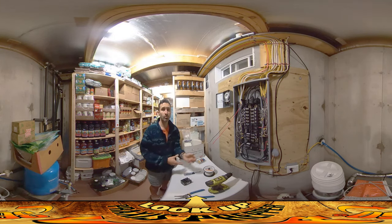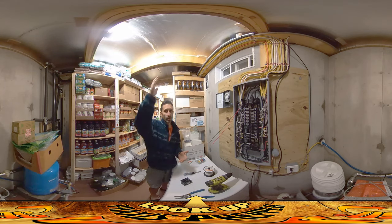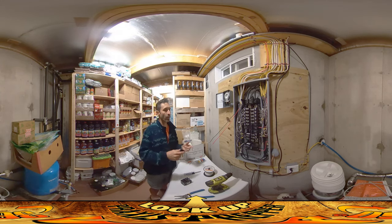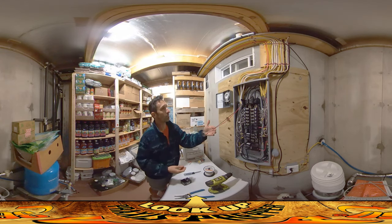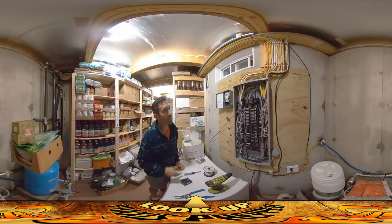This is like a light switch — when you have a light switch in an electrical box, you have the ground that comes in and grounds out the box, the white wire just continues through up to the lighting fixture, and it's the black wire — or in this case black and red — that gets switched. So that's what this is gonna be, but instead of just the black wire getting switched, you have black and red because it's 220V.